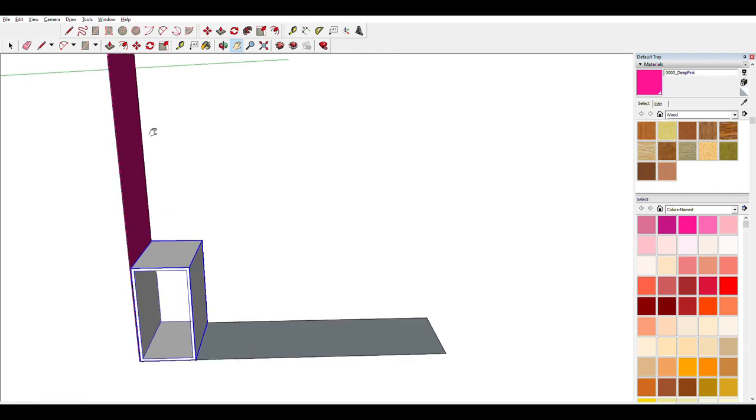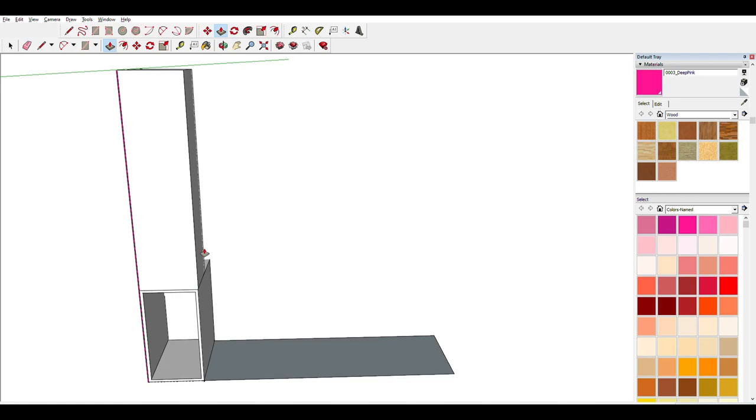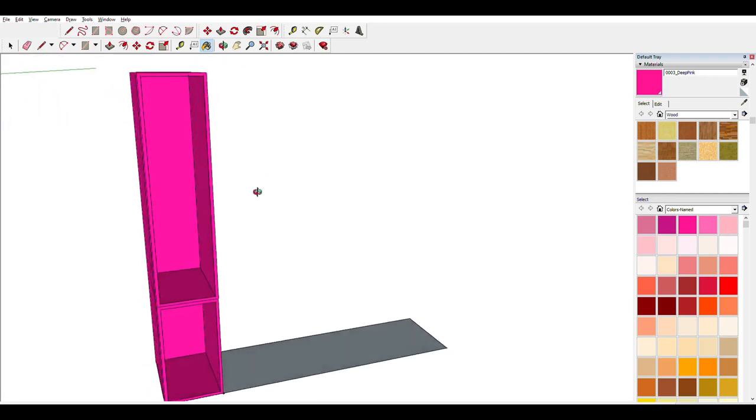Then I can actually make my top box. Now I don't need the calculator for that because I've got the tool, it's all open. We can just measure that. It's 1454. So I can then come down here. If it lands on it, which it has done in that case, I'll do it. If not, I just literally type in 1454. I won't try and hit the 600, I type the 600 in. We'll do the same thing with the offset because I'm making that out of 18 mil board. That is actually going to be 590 deep for the moment. I might change that though, I'm not 100% sure. But for now, for a construction drawing, this will do. And as I discussed, we're going to do these that color just to make it a little bit simpler.